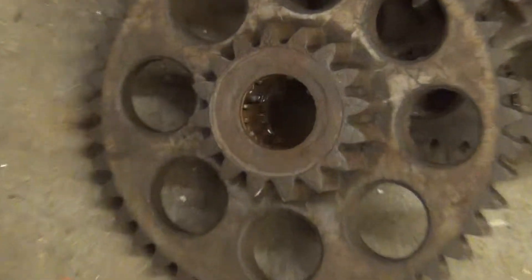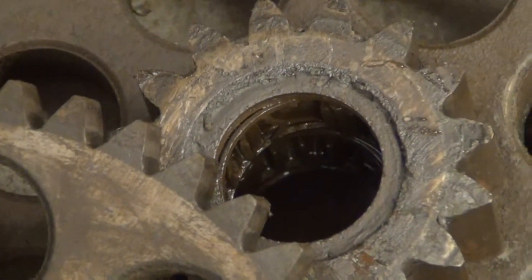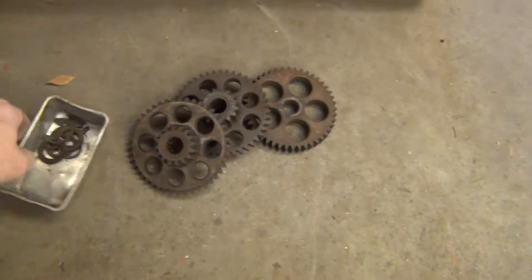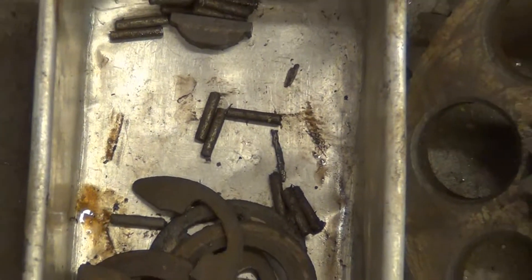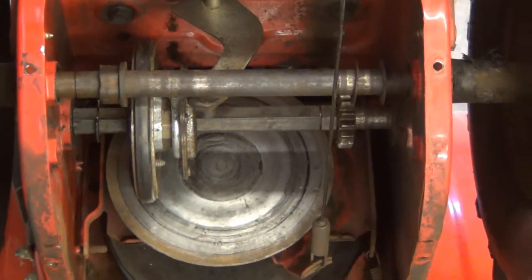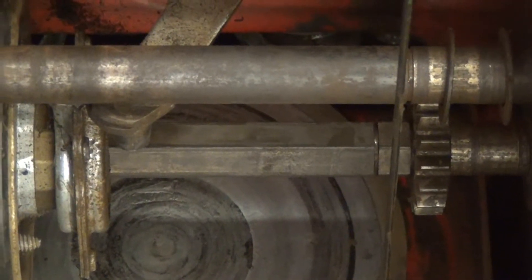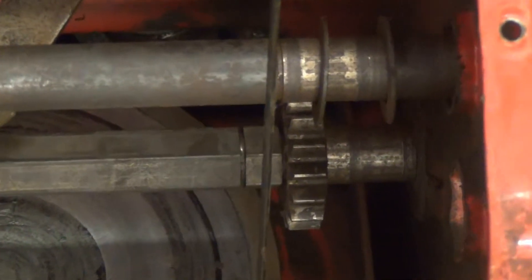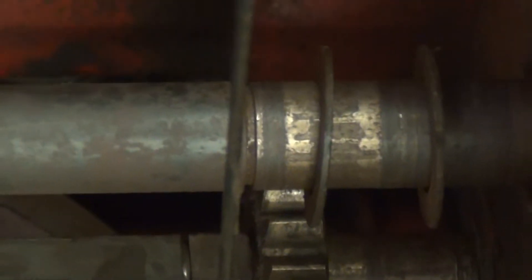Here you have some of the gears. I took off the axle shaft and the speed shaft, and you can see the gears are really rusted up. The roller bearings are mostly missing, and they're just full of rust — the bearings just won't roll. I took the gears off the right-hand side here on the speed shaft and the axle, and you can actually notice the impressions of the roller bearings on the axle and the speed shaft. When you use the machine, it gets a little moisture in there, and then when you stop and shut the machine down and it sits for a couple of weeks, they just rust together.